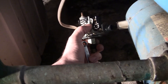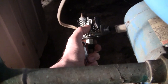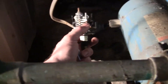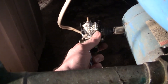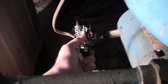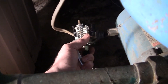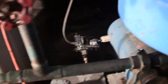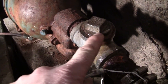This is your low kick-on pressure setting here on this side. Now if it gets down too low, you stand the chance of doing what I did — running your pump dry. For some reason I think I have other issues with the foot valve, but we're going to see. So if you have too low pressure and the pump is kicking on too low, you want to crack that in and that will bring the low pressure up. And you can see I have a leak here that I'm going to have to address tomorrow.